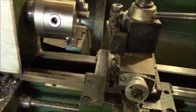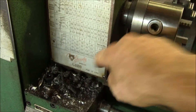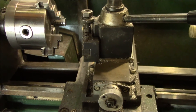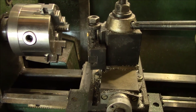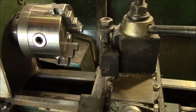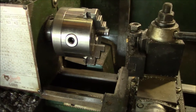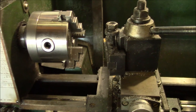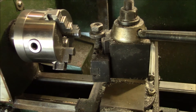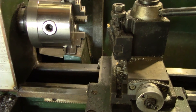Hopefully that'll do the trick. If you have one of these Grizzly G4000 lathes, that's a good little thing to do — those motors don't like getting stuff sucked into the fan blades. I should have fired up the camera before I cleaned out the motor; it was pretty loud this time. A piece of polyethylene was wrapped all the way around and made quite a racket when running. You've got to keep those fan blades clear. Thanks for watching.